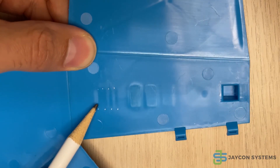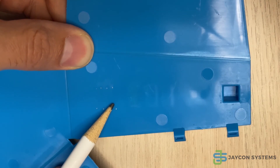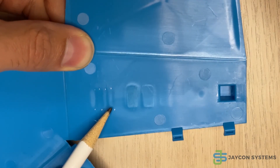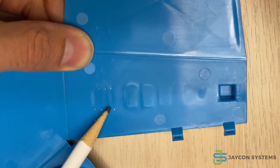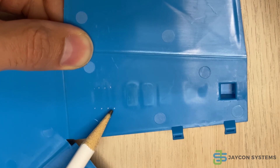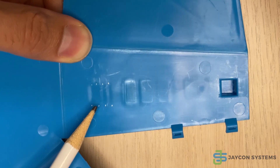Although it can be manufactured, there are aesthetic issues where you can physically see the shrink marks and defects on the opposite side of the plastic. Up here it's very difficult to see because it's almost non-existent — it was designed according to specification. This also changes depending on the actual material you use, so it's very important to design these correctly.